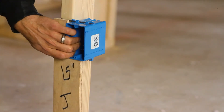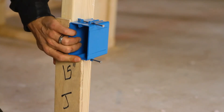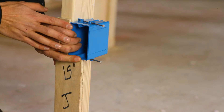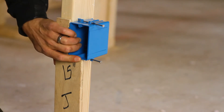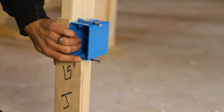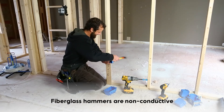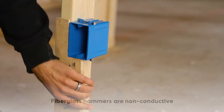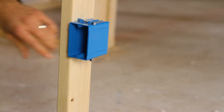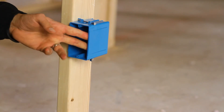I'm going to flush my jig to the floor, reverse my box, and flush the palm of my hand to the face of the box and the jig using a fiberglass hammer. I'm going to set my top nail, set my bottom nail, and drive my box flush. It is a code requirement that the box be secured to the framing without any wiggle or jiggle.